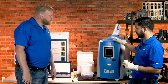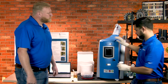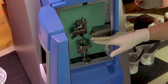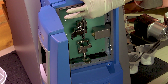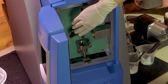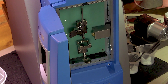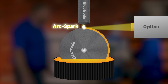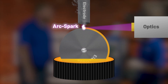This instrument can analyze 24 elements. This type of elemental spectrometer is an RDE — Rotating Disc Electrode. As I open this up, there's the disc. I'm also going to put in this rod — these two are graphite electrodes. Once I position them at a certain width and lift this up and down, a spark is created between the two. That spark burns the oil, and the burning oil creates light, which is picked up by these optics and analyzed by the CCD chips in the back.